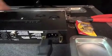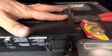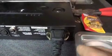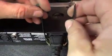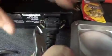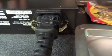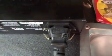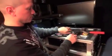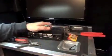From there, if you just take a standard IEC cord, you can plug the cord into the socket. You can bend these brackets out here, take a tie wrap — there you go. 20-cent IEC hook. Next time you need to service your gear, the nice thing about this — here's your service access.